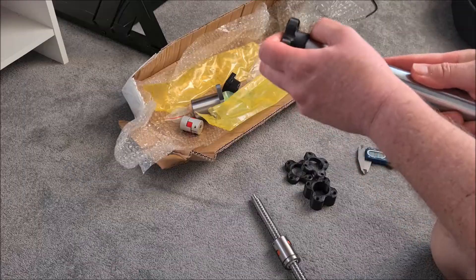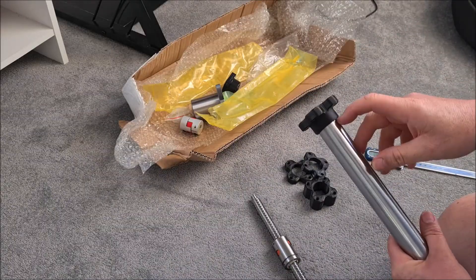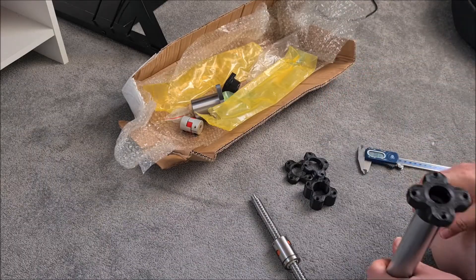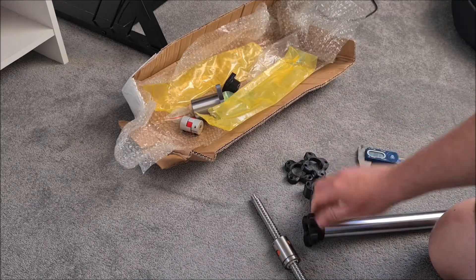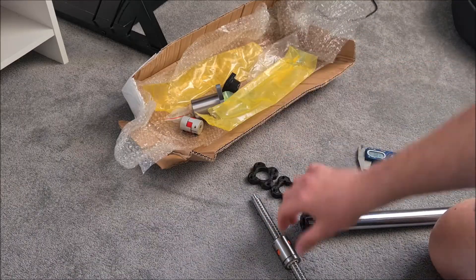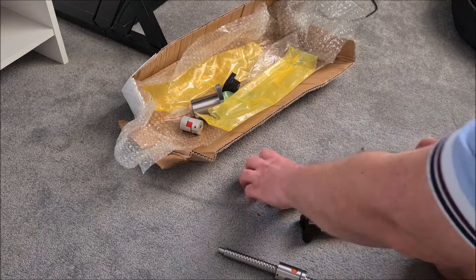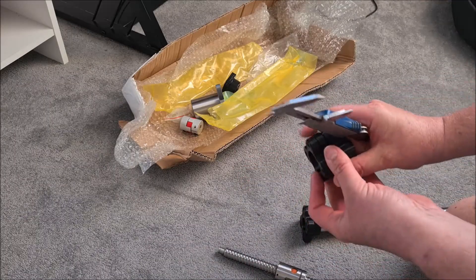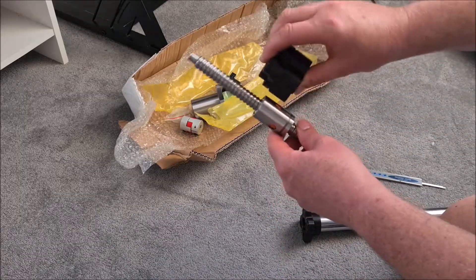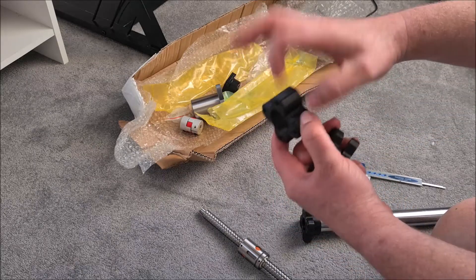It needs to be slightly bigger so it stands half a chance of sliding on there nicely. One thing that has worked out quite well is the hole in this lower part of the slider is a really nice fit on the shaft, so no more needing to put masking tape on like on the original SFX100. I also noticed that the length of the bearing is 45mm whereas the stack of parts in the middle of the slider is 46mm, leaving a potential 1mm of slop in operation. So as I've got to reprint these with a bigger hole, I'm going to take 1mm off the height of this part.